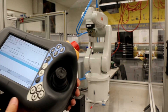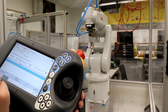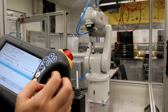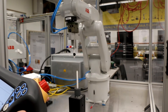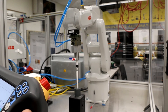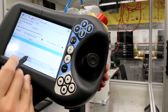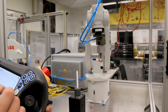First, move the robot so the tip is on top of the pointer reference point. Go to dragging to maneuver. This position should be close to the reference pointer but not touching it. This is our first position. Modify and save this as point one. Then move the robot to another position — for example, approaching from the right side — and save it as point two.